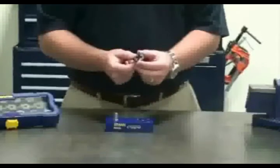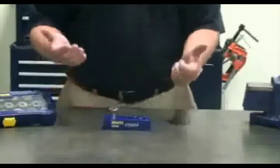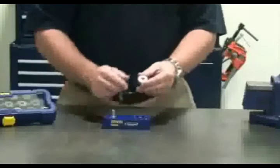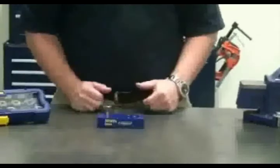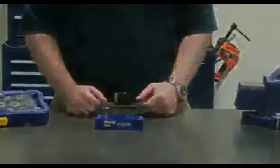With a standard 1-inch hex die, when you take it and place it on the post, it's very difficult to get it aligned. Then if you take a die stock or some other type of tool and put that on there, it's even more difficult to make sure this is straight up and down. With our Irwin Hanson performance threading system self-alignment die, now when you place that on the post, it aligns itself straight every time. Again, taking the guesswork out and making the job easier for you.